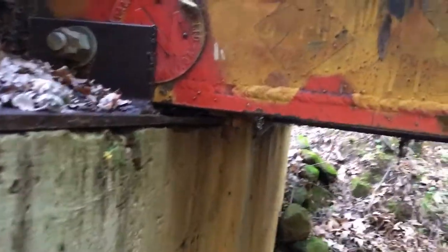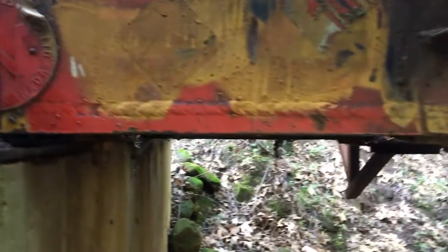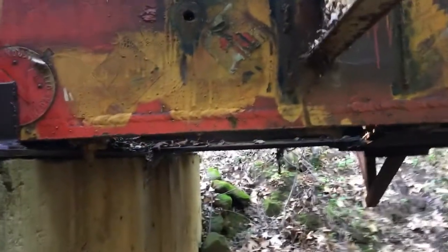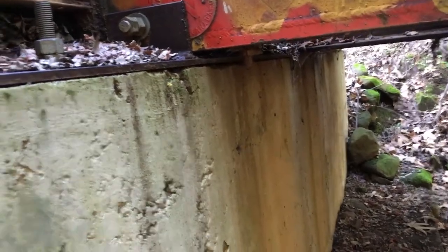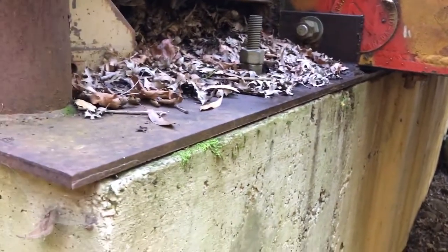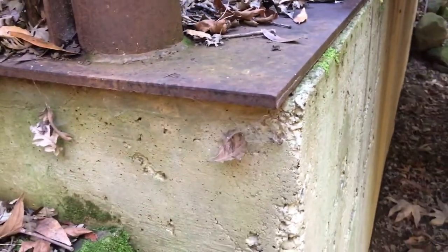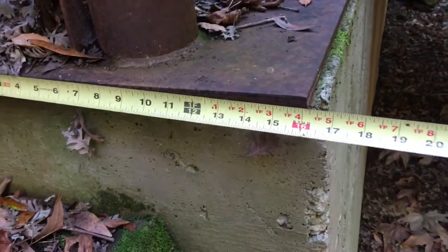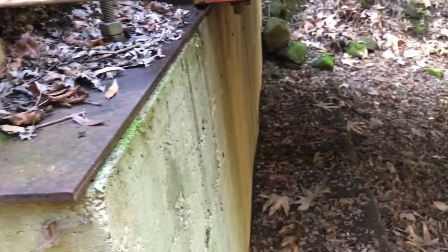It says Canadian rail car. The abutments — well, the bearing plate — are very interesting. They have the steel plate here bearing directly on the concrete, which is something that we typically do not recommend. But this one's been sitting here for a number of years. That's 16 inches, which is kind of an odd number — usually you see anywhere from 10 to 12.